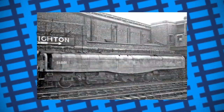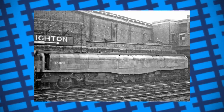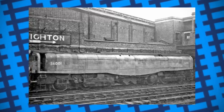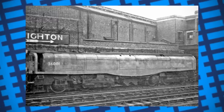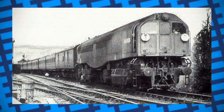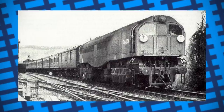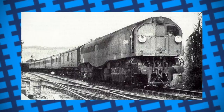It was also pointed out that the fireman's cab only had one door, and that if the engine were to ever roll onto its side, the fireman would be trapped, which didn't sit too well with the railway trade union. During a brief maintenance service, it was found that the engine's centre of gravity was shifted to one side thanks to the positioning of the firebox and boiler. The other side was balanced out with scrap metal, but this led to the locomotive simply being too heavy for some of the routes it was meant to travel. The engine possessed outstanding steaming characteristics and could keep up with its scheduled times when properly fired, occasionally running ahead of schedule. However, it consumed water at a rapid rate, and its height meant it couldn't fit under most water cranes, making it awkward to refill and causing it to lose any time it may have gained on a run.